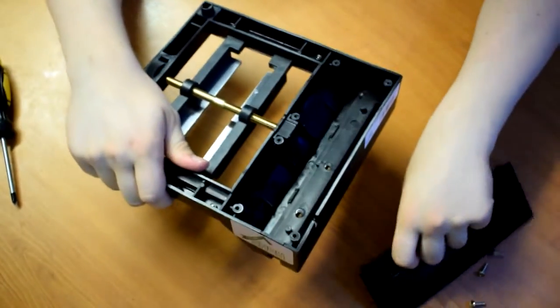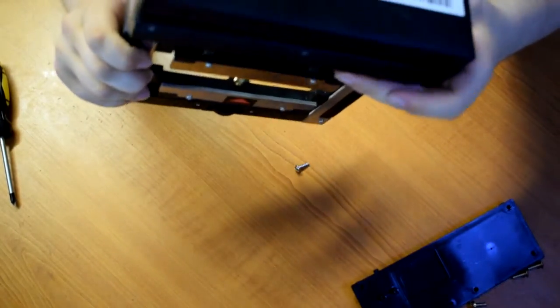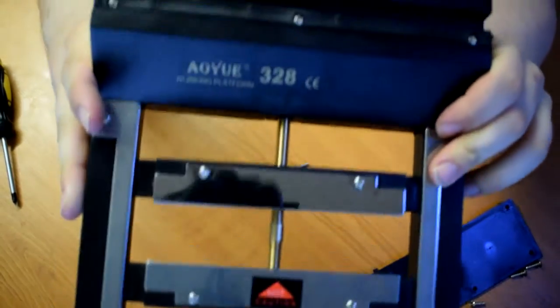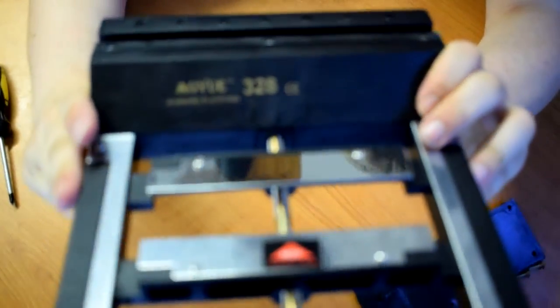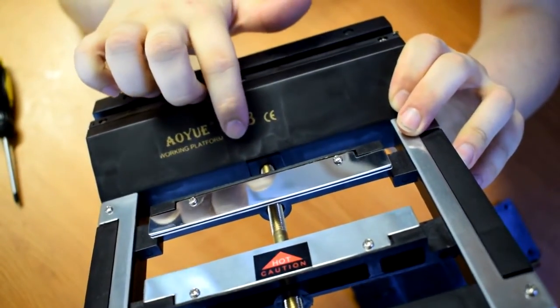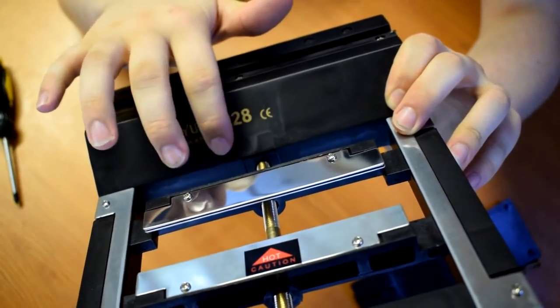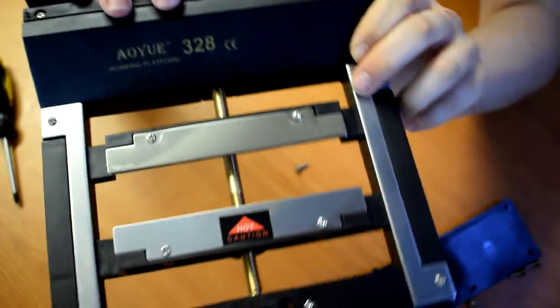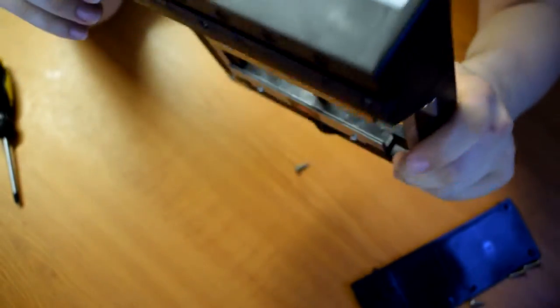So they definitely use the same moulding for both. There might just be some different inserts they put in the injection moulding tooling. I don't know how well you can see that, but there's definitely some flow lines visible. You can just catch it there on the outside of this, and you can actually feel them as well. So it's not very well injection moulded, but it was £17.